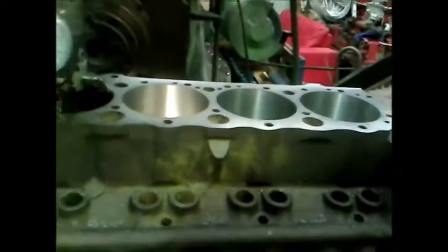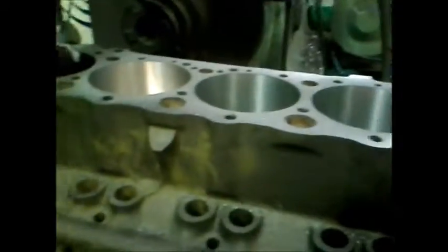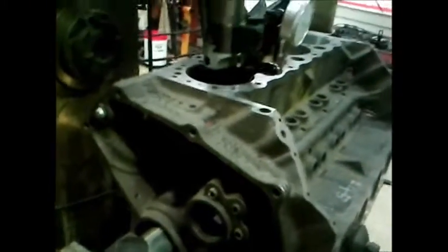Then you can surface your top square with your main tunnel, and you can bore your cylinders square with your main tunnel as well. There's a lot of talk that goes into square decking and square boring. A simple setup like this — which is just a fairly standard setup that you'll find most shops using — will produce the same results. It's just an easy way to set them up.